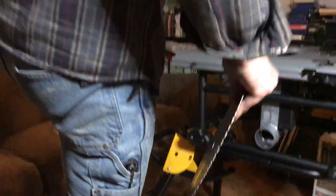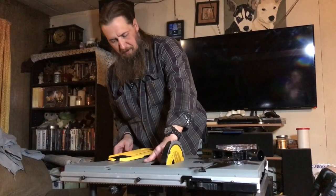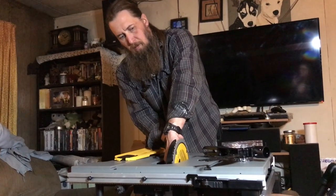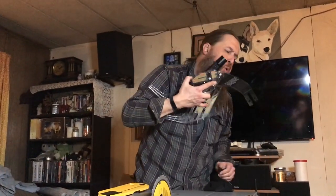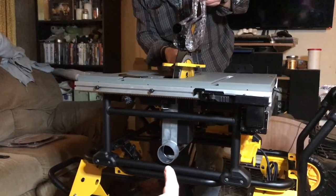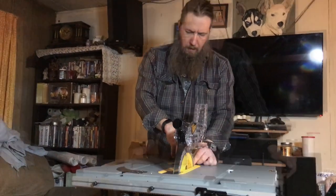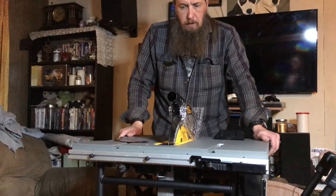It's like tread on a tire — you've gotta clear out the muck or it won't cut. It rotates towards you, so you always have to be careful on the end closest to you of things getting caught and pulled down. Loose sleeves, loose hair, baggy shirts — this is for the super safety thing. That's the dust collection port, and that also is dust collection — this would be for finer stuff. You just hook a hose up to it — hook it up to a shop vac or just let it puke off. There's that stuff. Sweet.